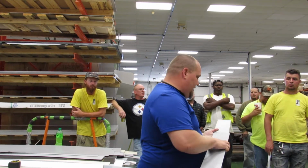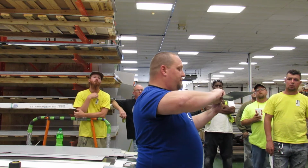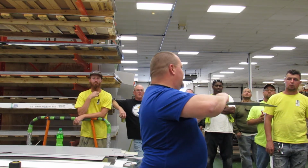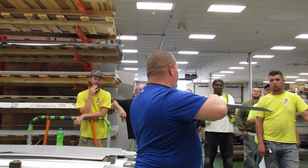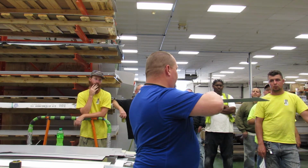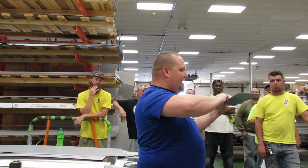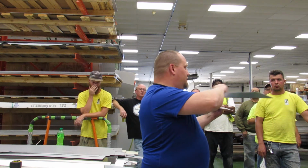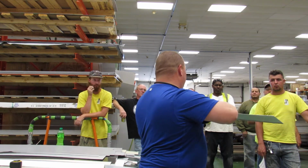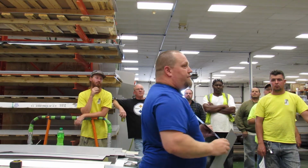So basically what we're saying, and I don't have a splice place for this, but if you're putting a sill flashing in and you do a splice that is over 20 foot, you need to have a 1/4-inch joint in it. So when you do your metal, you need the same finish color metal underneath it, and it needs to have a gap between it. You're still caulking both sides. You're still caulking all of it, and it may not seem like it, but it'll move, and it'll keep you from having that stuff falling up.